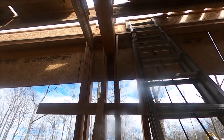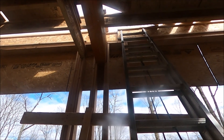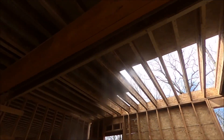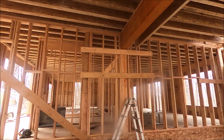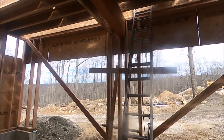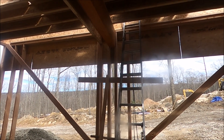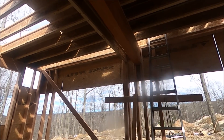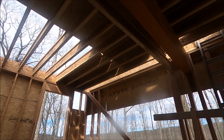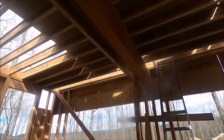Okay, took a little longer because I put the cables in the wrong spot, but the beam's up there. That size is pretty much set — get a couple more two-by-sixes underneath over there, and I can take out the temporary support we had before. There you have it — I'll see you in the next one.